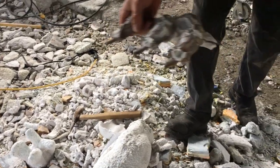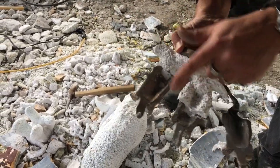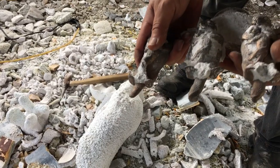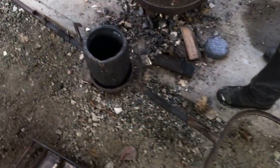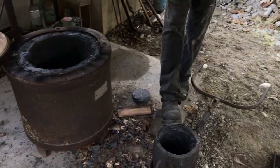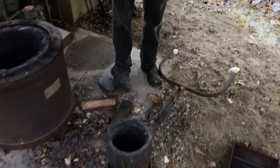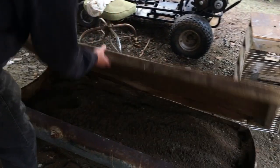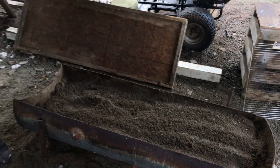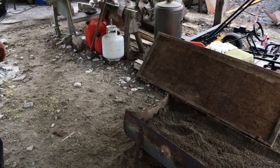Here's a shell that's been cast with bronze — all cooled down. I'll break the ceramic shell off now. You can see the little otters right there, along with the sprue bars and air vents still attached. We'll nick those off, cut the otters free, sandblast them, and get them ready for patina. Over here is the crucible and the old furnace from the 1950s — a size-30 crucible that holds 90 to 100 pounds of bronze. The burnt-out ceramic molds go into a sandbox with cups facing up, and we pour all the pieces at once.